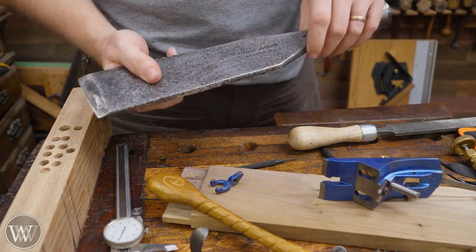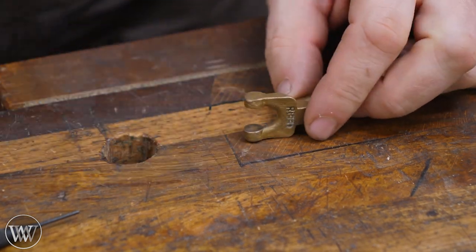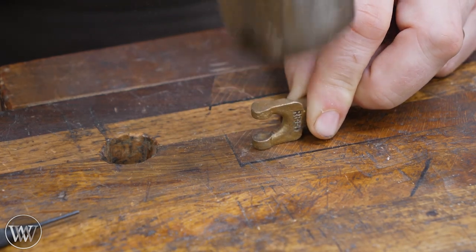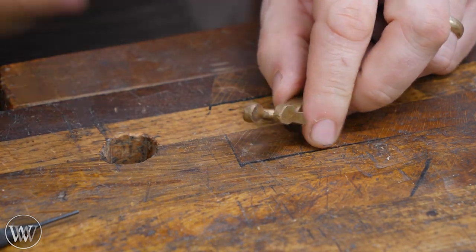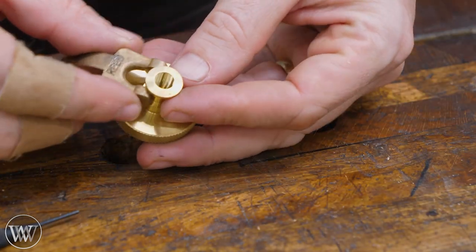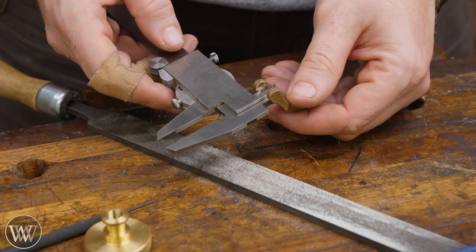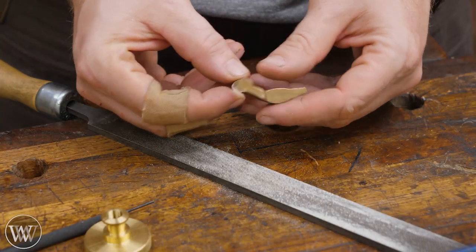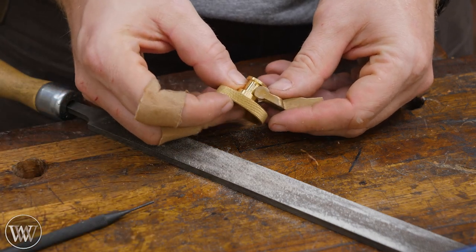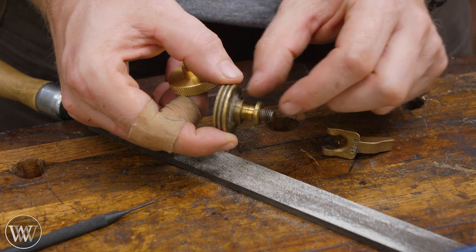Another idea is to grab a firmer chisel or a big slick, come in and measure exactly where that thickness is, then put this on and slide it up until it reaches at least that point. If your yokes are a bit too wide and you need to crush them down, put them on top of the leg of your bench with a big mallet and give them a good tap — that will squeeze them back together so you can file them to the exact fit and get a nice snug fit so it doesn't move side to side.